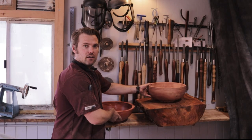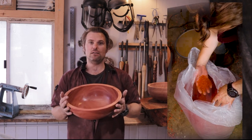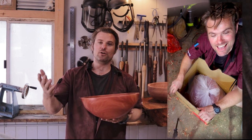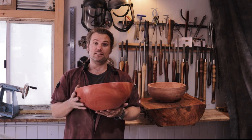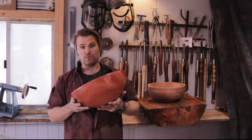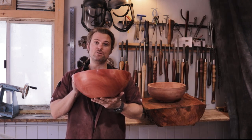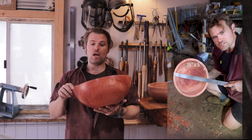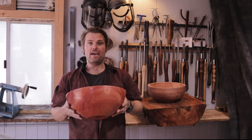Once I cored it, I put this blank into a box of 25 kilos of silica gel balls, and it was part of a competition that I'm doing on my channel where the people had to guess how long it would take for the silica to dry it out. And it only took 3 days for it to get this blank under 14% moisture content. The blank at the time was 16 inches in diameter and 1 inch thick by 6 inches deep. So it was quite a hefty blank.